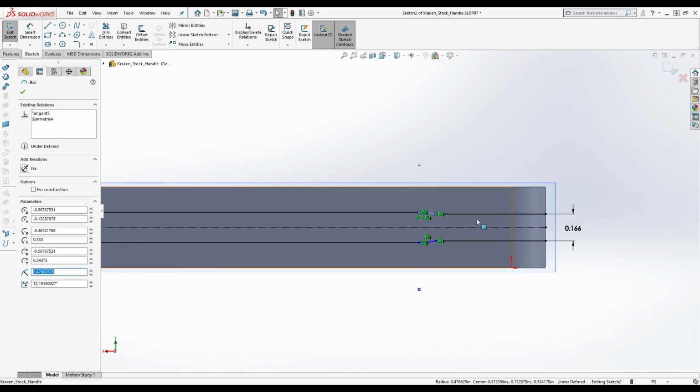Or you're going to want to use like a 5/32 inch tool, because a 5/32 inch tool is about as close as you can get to 0.166 with a fractional system, right? Unless you order custom tools, okay? So it's also going to give you 5 thou clearance on each side, which is probably plenty for getting coolant in. And plus, it's not going to be on either side when you're cutting. It's going to be a total of 10 thou on the side you're not cutting on, right? So that gives you a chance to get coolant in there or air blast or mist, whatever it is that he would be using, right?